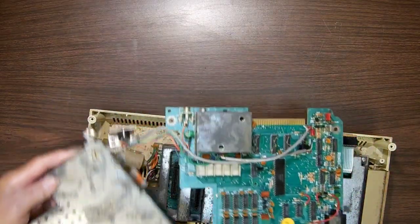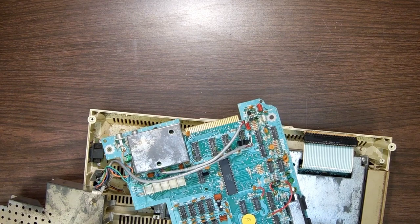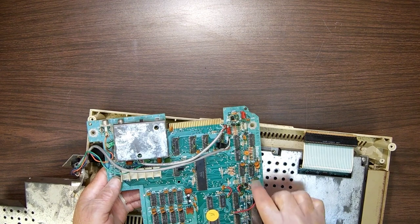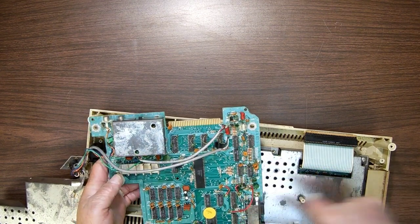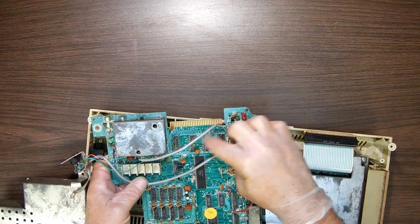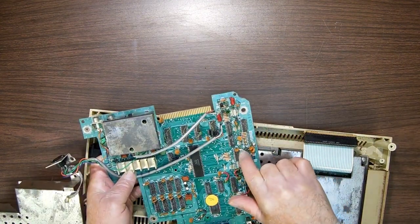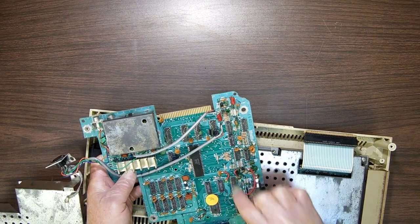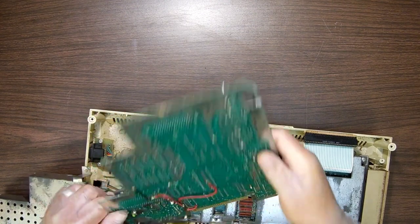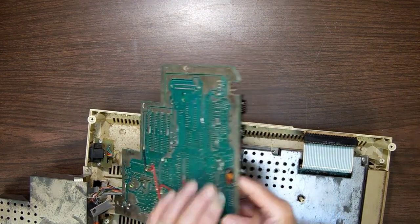All right, any of you Adam geeks out there like me, you don't solder things together, whoever did this one. Any of you Adam geeks out there, oh, God. Look at this everywhere. I mean, how many fixes are on here? Each one of these has a capacitor across the top. Why, I don't know. Then you have patches there. You have these wire patches, these patches here, these patches there. An RF shield, I've never seen an RF shield over the controllers. And then when you flip it over, it's all patched up again on the back. These are not factory repairs. And then this.